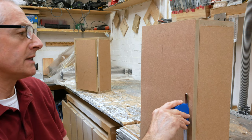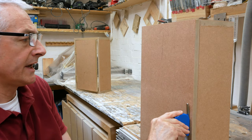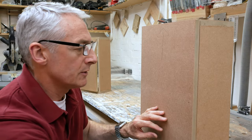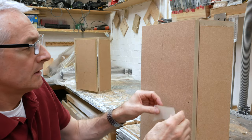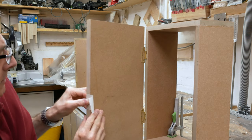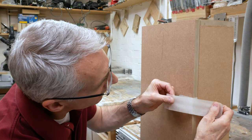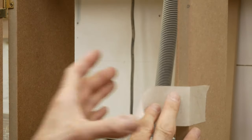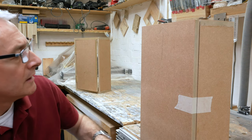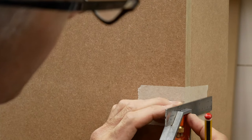With the halfway point established, I'm going to take the knob position up very slightly above it, then come down a little bit and fit the catch just under there. With that height established, put a little pencil mark on there, and then what I want to do is put some tape around that door at that height — it doesn't have to be exact — going all the way around on the inside as well. Then we can do the same thing on the cabinet carcass. Move the door out of the way and now we've got a nice clean line which isn't going to affect the cabinet at all.